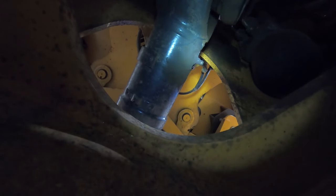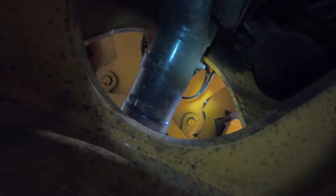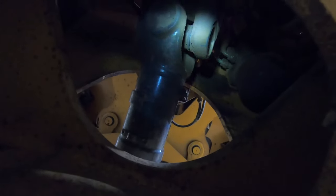There's a small nipple right there for the slip yoke on the driveshaft — we'll grease that. Then there's a universal joint to grease there as well. The carrier bearing has a grease fitting so that's continuously greased through the automatic system.